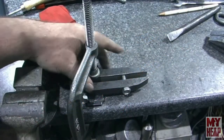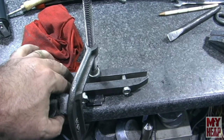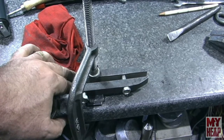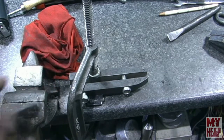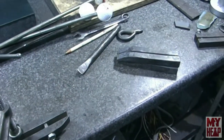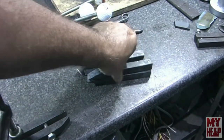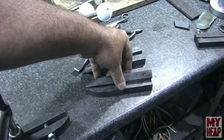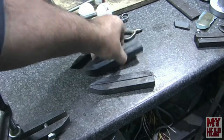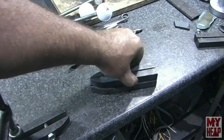So you see these little machinist clamps here. I told Chirpy, man, those are pretty cool. He says they're super easy to make - we'll fire up the forge and I'll give you some instructions and we'll make you some. Sure enough, he showed me how to make those, heat them up and forge them down. They need a little machine work but that's going to have to save for a project when I get back home. You can see they're nice and tapered - they just need to be drilled, machined flat, and have screws put in.